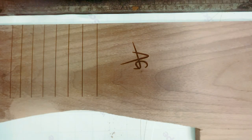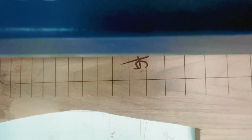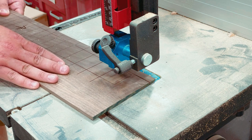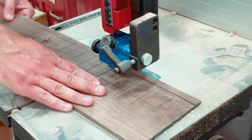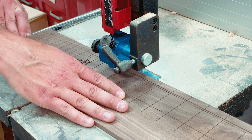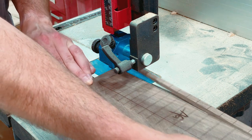I figured while I'm at it, I might as well also use this to mark out my fret positions. That's one where if you don't have a laser engraver — which you probably don't — or an appropriately small bit for a CNC, you're going to want to do this by hand. What you'll do is you'll mark the center of your fretboard, and then you'll use a quality square or protractor to make your perpendicular lines. If you're looking to figure out what exactly the distances are, there's a scale length calculator on stewmac.com that you can use. I've gone ahead and used a laser engraver, which has been convenient because it also makes basically a little cut line there — a nice little ridge for me to run my saw through when I go to do my cutting.